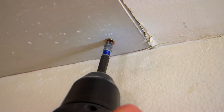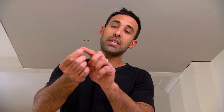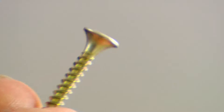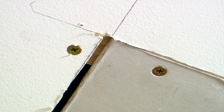Then screw around the outside and down the middle into the joists. You just want to make sure that you use plaster screws. You'll see with the timber screw it has ribs underneath the head and that helps it countersink into the timber. But for the plasterboard you want to make sure that the screw is nice and smooth underneath because when you put it in you just need to finish flush with the paper. You don't want to countersink it otherwise the board will just pop.